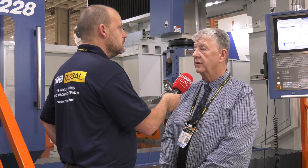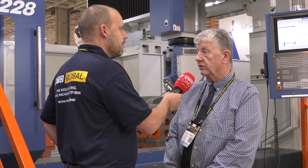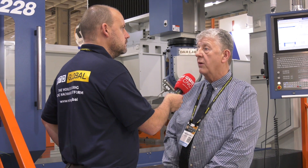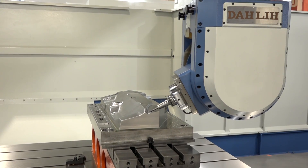The main important thing for that type of head is we've got full power — the same way we've got full power on the vertical spindle — so it's not like a traditional tool-changeable right angle head where the power is very weak. That's very necessary as well, especially if you're doing operations like the ones being demonstrated here on what looks like a press tool.